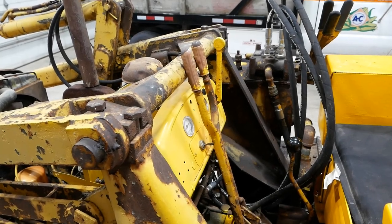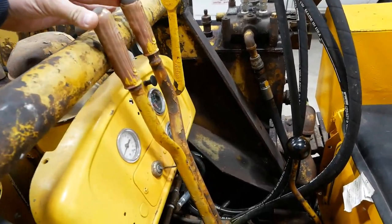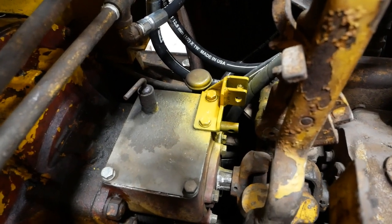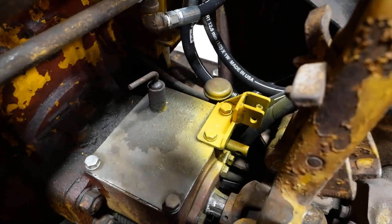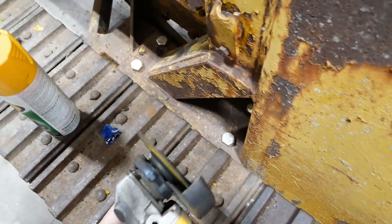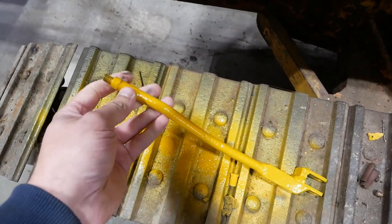All right, folks, you may want to brace yourselves before I hit you with this shocking revelation. I found a few problems. We'll let that sink in for a minute. First ones are pretty minor. This bracket that I made for the reversing lever, it was hitting the floor pan when I tried to install it, so I had to cut the corner out of that triangular brace. No big deal, just use the old OSHA wheel here. And then, same thing on the lever. I ended up having to shorten this because it was too close to the firewall in the forward position.